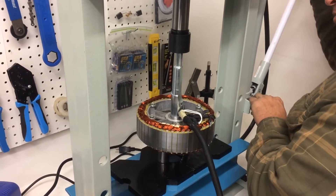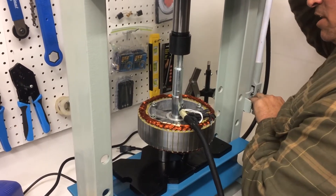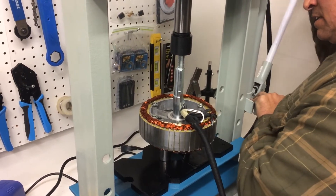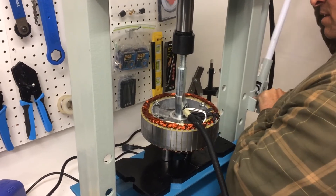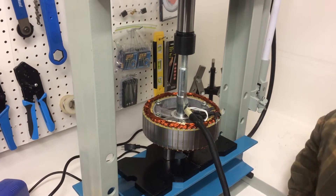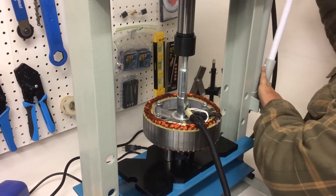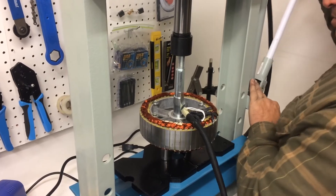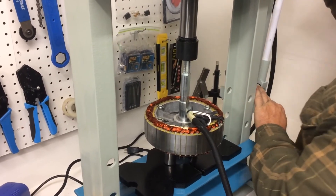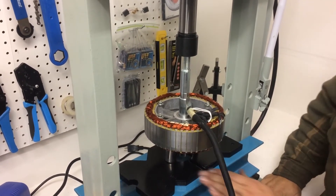Hopefully it'll be aligned — and it looks like now it is aligned. There's a little lining pin in there and it's going in very easily. I'll check my support system down here — the support system is good and the clearance is beautiful. It's going to go in and the shoulder is going to stop it. We've still got another inch and a quarter. It is skewing a little bit so I'm just going to hold it.